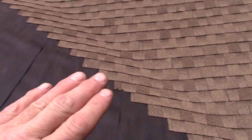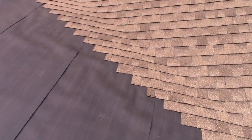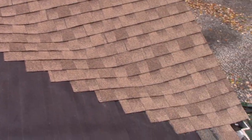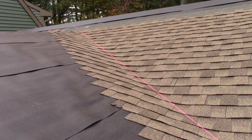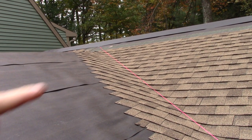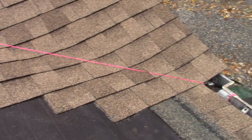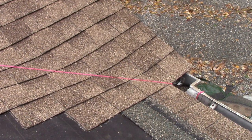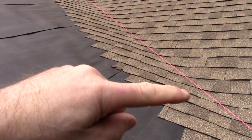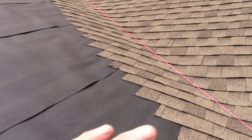What I've got right now is going up the slope here, and I want to show you how to make this easy valley, plugging it in this way — really simple to do. I'm going to lay a few strings down just to get my valley back. I could see it, but I'd rather use a string to lay these shingles. The first thing I did was tie a string up there to represent the valley — I nailed a nail up there where it's unfinished, used some mason string, and took it down to the corner and caught it in that notch there.